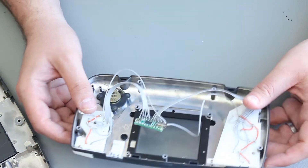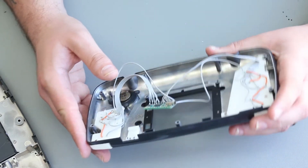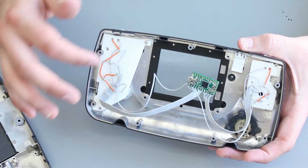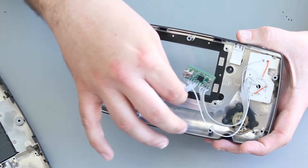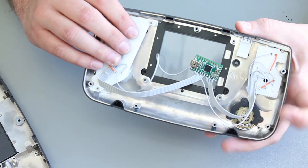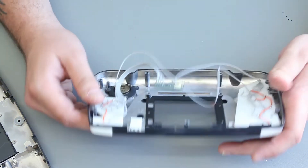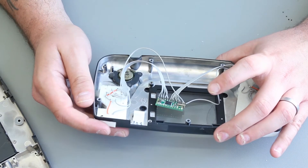In order to get to this stage, what we've done is designed some bespoke components to fit inside the Game Gear and then printed them out on a 3D printer. I have plates on the left and right that house the buttons, and then I've wired the switches up to those and then to the Teensy. We've got a left and right switch plate and then left and right triggers.